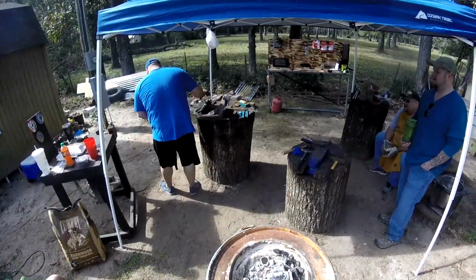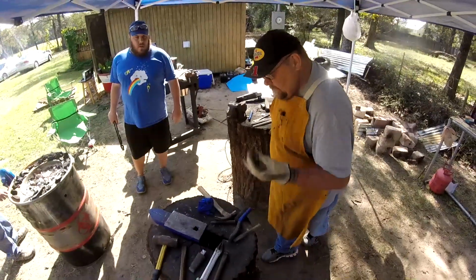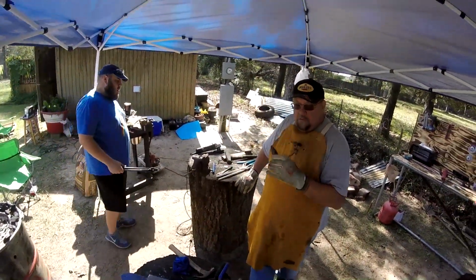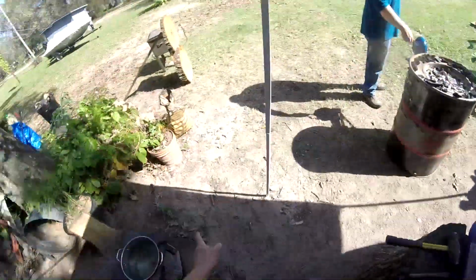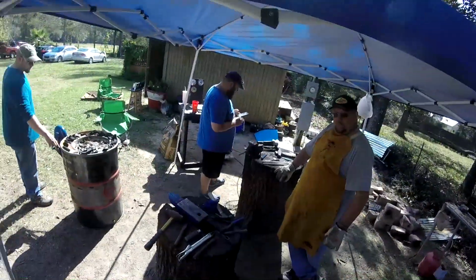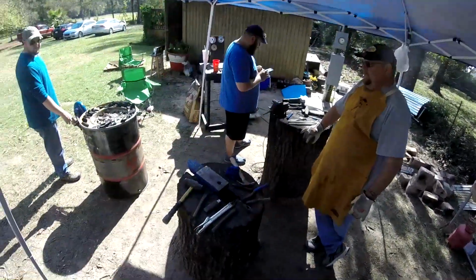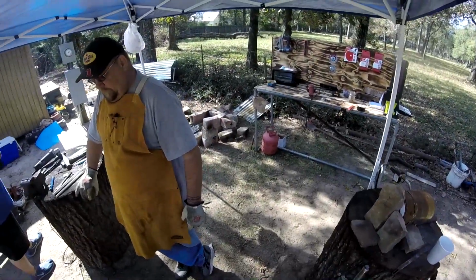Take that blade off my grinder. Oh, we're recording the whole day. Yeah, I let it normalize. I just let it sit there. It's still a little bit warm. It was so hot when I quenched it in the water, it pulled off like an inch of scale. That's how hot it was. It was malleable, like you could flatten it out, for sure.